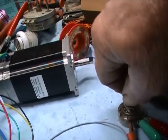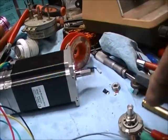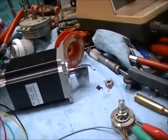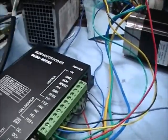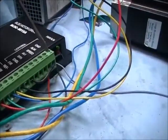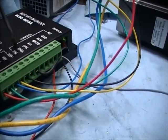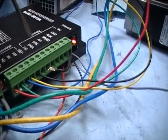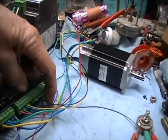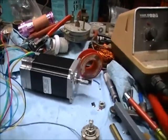It's a 3,000 RPM motor. I've got to mount this potentiometer to the front of my welder and put a knob on it, and then it will control the wire speed — right where I want it. On the box there's this black wire that goes over here to the enable terminal. So when you're welding and you let off the trigger of your MIG, you break that connection and the motor stops. If you push the wire back together into the enable hole, it's going to instantly turn on and go at the same speed it was going.